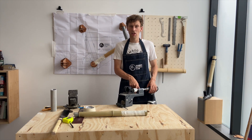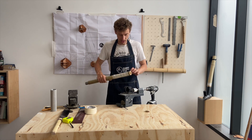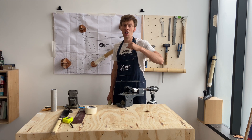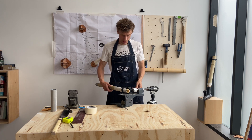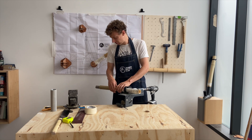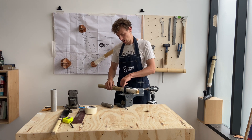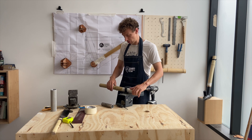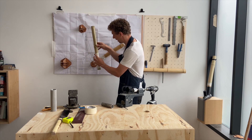I'm going to set the tube cutter to zero so it's the same flat angle as the downtube cut I made, keeping it a perfectly square circular cut so that when you pedal everything is nice and square. I've got some features on the bamboo so I'm just going to work with them — there's a little branch mark here which is naturally occurring on the bamboo, and I'm going to position that groove facing the back of the frame.